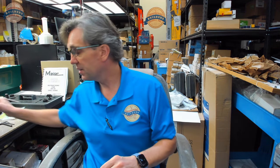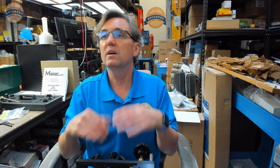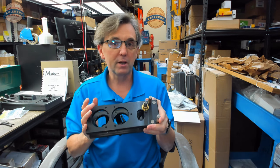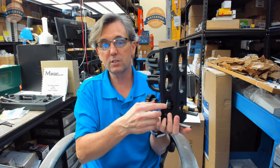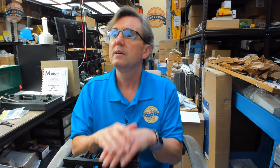Now they talk about clamping the door. Simply determine the height and clamp. What they mean is, with a lock installation kit like this, because so much of the process has become ritualized, meaning you don't have to measure 2 3/4, it's done for you. You have to make sure the tool's set up correctly. These bolts have to come out. And you should be, of course, putting a tape measure on it to make sure the tool is in the right place.